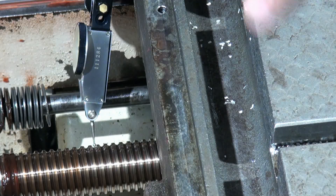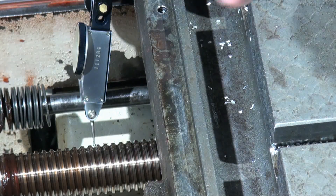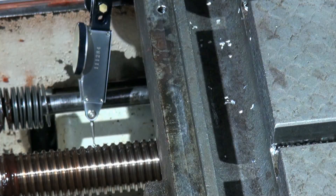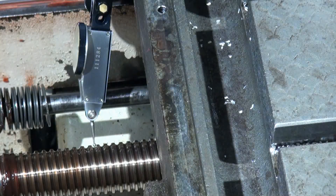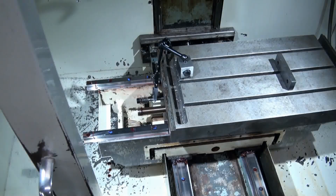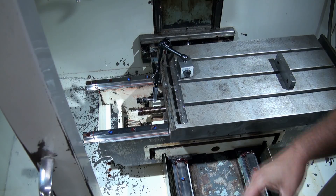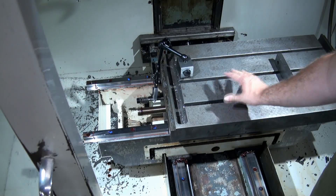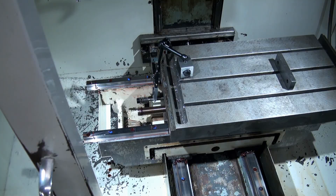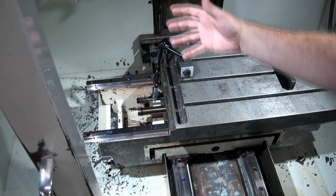Also, while this test is set up, if you put the indicator on the crest of the thread in this axis and then 90 degrees, that is how you can test to see if your ball screw is running true. Put it on the crest of the thread, run the axis in and out, then move it to the other side and run it in and out. If your ball screw is running nice and true and straight, that test indicator is not going to move — just like our other alignment tests, it takes a reference of the rails and compares it with the ball screw. We want to do this after the machine is aligned, then we can align our ball screws.